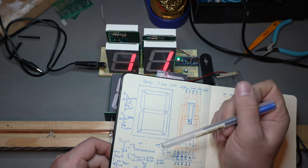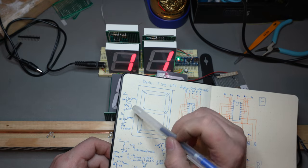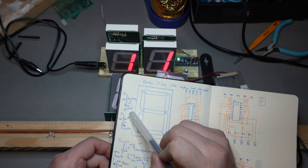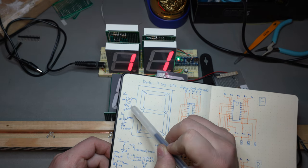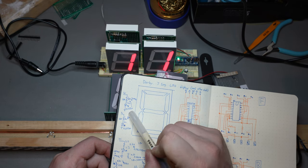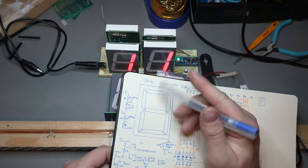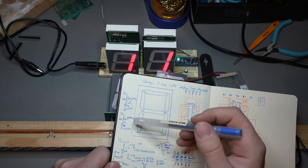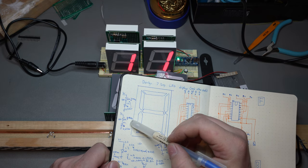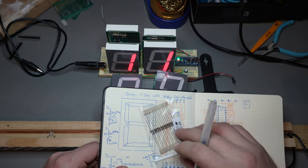And at 62.5 milliamps, that means that resistor is like 33 ohms, which puts their whole system per resistor at 112.5 milliwatts. That's like a little over a tenth of a watt. So they probably have like quarter watt, maybe half watt resistors down in there. And looking through all my options, I think the only viable one is, again, the 5-volt rail, and then we're gonna swap out their resistor with one of these.